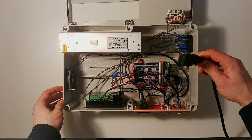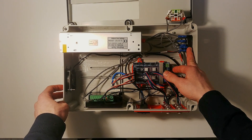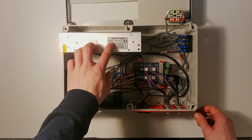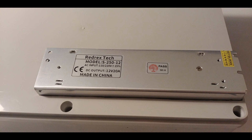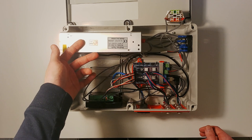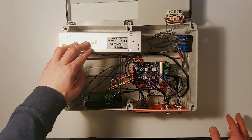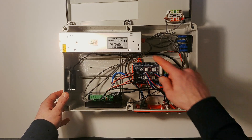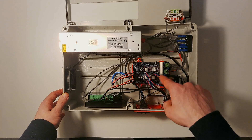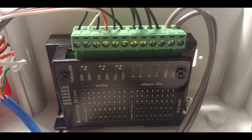I'm lucky enough to have one of those power cables growing underneath my table. The power is fed from the IEC connector through the emergency stop into the power supply. This is a 12-volt 20A power supply, so in theory it should give us 240 watts — but it's a cheap LED power supply, so who knows what it actually puts out. From this power supply, the 12-volt cables go into two separate places: one pair goes to the RAMPS board for input power to the stepper drivers, and there's another line going to the TB6600 stepper driver.